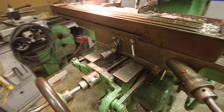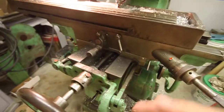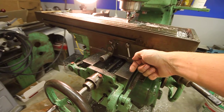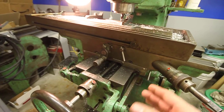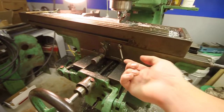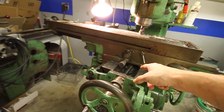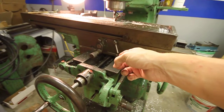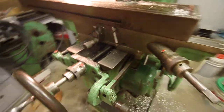Those are the infamous shear pins on these machines — I've had to replace one already. I'm assuming that on that end the Y screw would just come out this end, but I'm just not sure if it would be possible to do it without removing the table to get at the Acme threaded nut underneath the table. So that's kind of what I'm looking at.